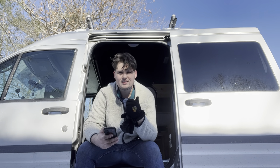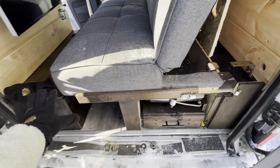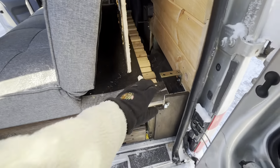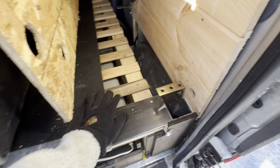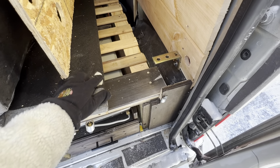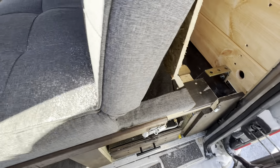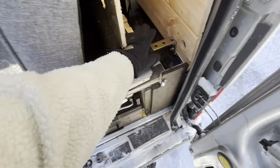We got the futon that's in here — that's from Walmart, that was $89. The way I built the bed was: I got this futon, then I built this frame. The frame is set up with beams across the way — three on each side. On top you have these slats, and then extra slats that go across for extra support. The bed actually doesn't lie on those, but just for extra support. The way it slides is I have this composite material — basically aluminum — and I throw some silicone lubricant on that and it just slides back and forth, locks into place.